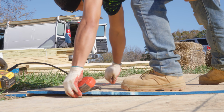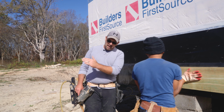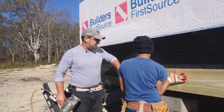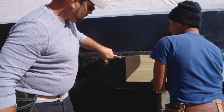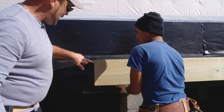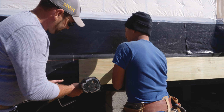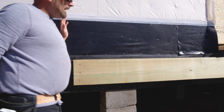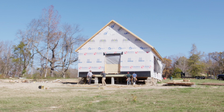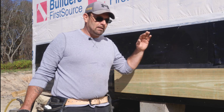We're going to move this ledger board 1.5 inches in of our overall dimension so that our side band ledger can actually go to the house and we can attach that with a metal fastener. So our overall dimension is going to come out to here, but our ledger band is going to be set in 1.5 inches. And we will attach that with 3 nails every 16 inches and then come back right behind it, and we're going to put ledger locks, a form of lag screw made for decks, in between each layout, same 16 inches on center in a zigzag form.